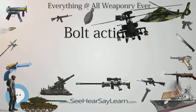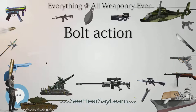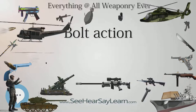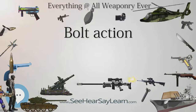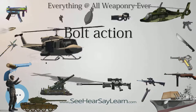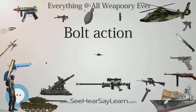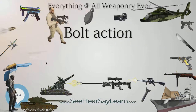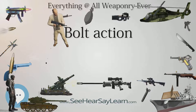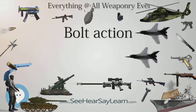Safety and Headspace: On used bolt action firearms especially, the headspace should be checked with headspace gauges prior to shooting to ensure it is correct, and to prevent overstressing chambers and cartridge brass. Some bolt action rifles, such as the Lee-Enfield, have a series of different length bolts available to extend the service life of the rifle, taking up any wear of the bolt and chamber occurring from long years of service. In the case of the Number 4 Lee-Enfield bolt, the bolt heads themselves are replaceable and are marked 0, 1, 2, or 3, with each bolt head in sequence being nominally 0.003 inches longer than the bolt head numbered one less, for easily taking up any action stretching. It is possible to replace such a bolt head without tools by disassembling the bolt from the action, unscrewing the bolt head, and replacing it with the next higher number bolt head, for restoring a safe headspace.